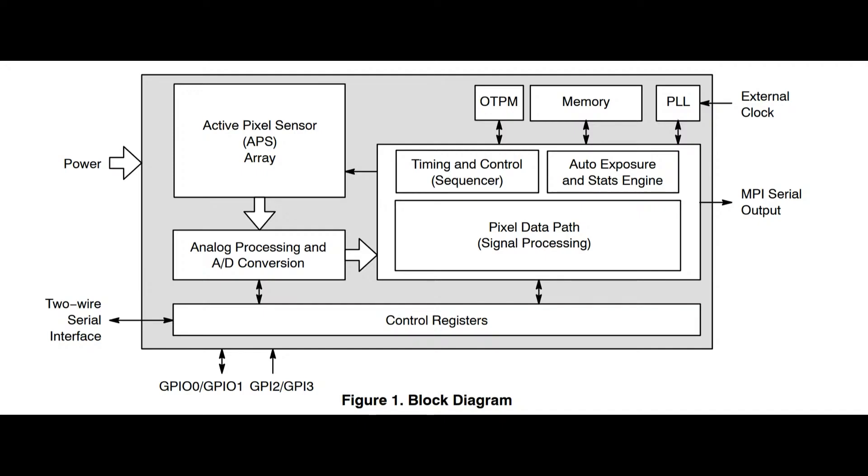That kind of imagery can be read by something like a Raspberry Pi, an STM32 F or H7 — I think it has a CSI input — or an Arduino Pro chip that has camera CSI input. Just make sure that you have something that can handle the MIPI/CSI differential input. But if you're doing high-end robotics, you probably have a high-end chip that can handle it.